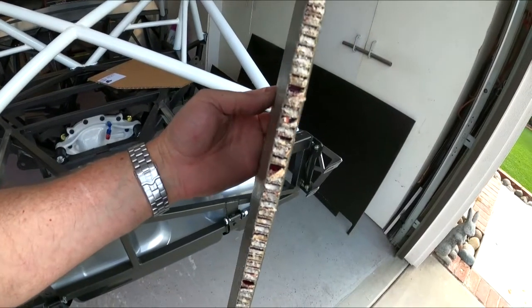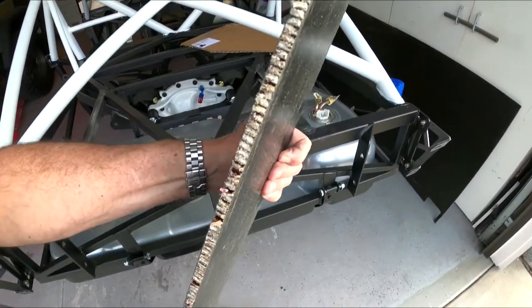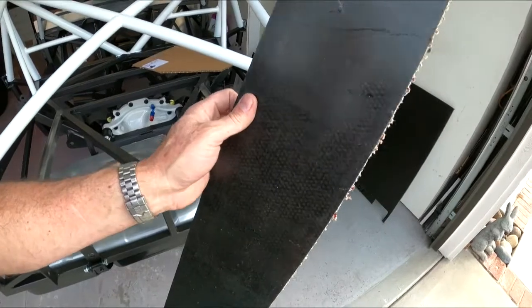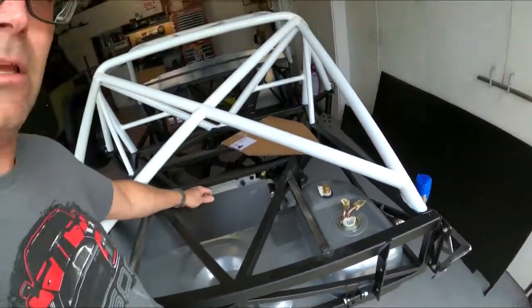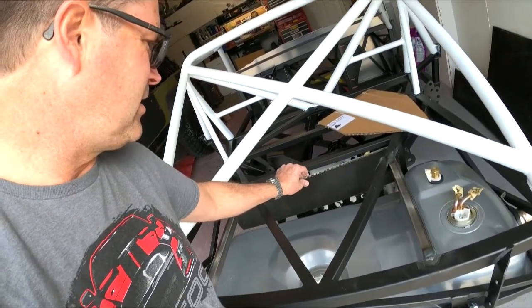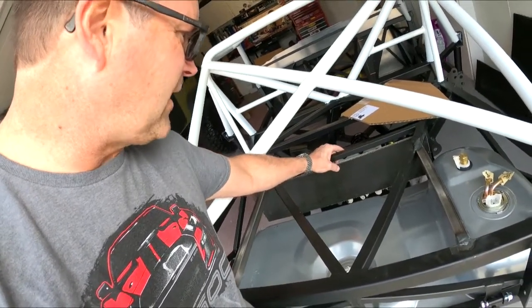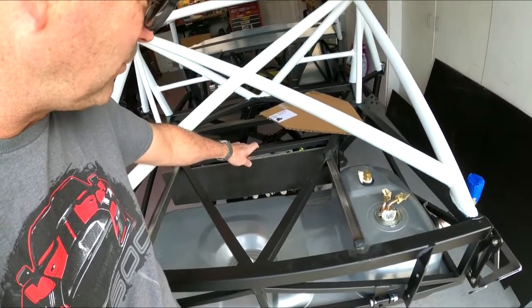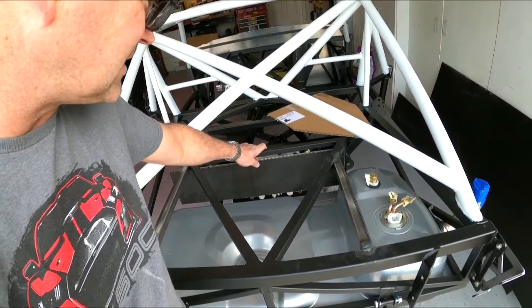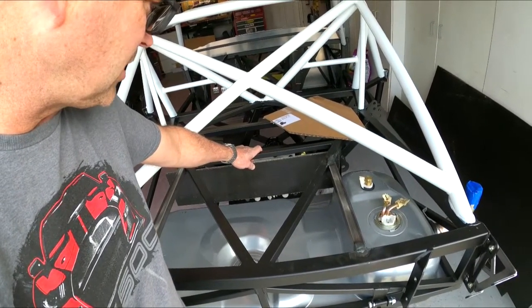Here's what you can see — it's a honeycomb. There's actually Nomex honeycomb and carbon fiber. It's not the prettiest carbon fiber; it's really a floorboard material, but it is strong. I don't know if you can bend this stuff or snap it — it dulls a saw blade really fast. So this is going to go in here. I've got to notch it out for these upper tubes and then screw into that back one. It'll slide all the way to the top edge and then we'll come forward, back, and make a box, then glass in the bottom. This thing will be rock solid.